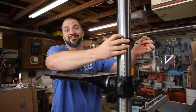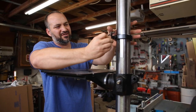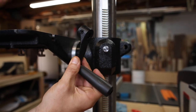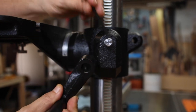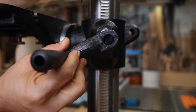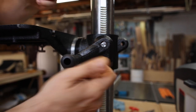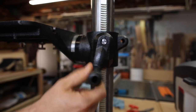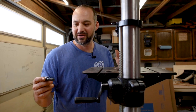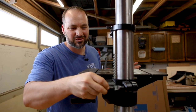Anyway, now I'm tightening the set screw on the collar. Now we're good to go — this thing should stick in there like that. Next up is the handle we use to raise and lower the table, and this right here is the post that goes on. It's got a flat side and there's a set screw in the handle, so the set screw fits on the flat part. Tighten it down and that's how it works. The next step is the column locking handle — the instructions show a ratchet lever handle in the diagram, but it comes with this piece instead and it's just easier anyway. You just screw it in.